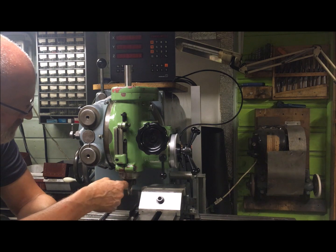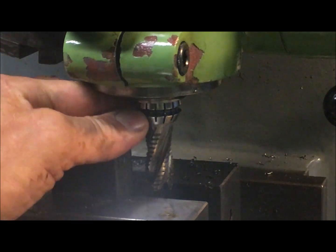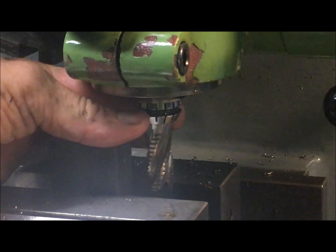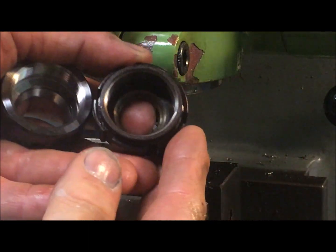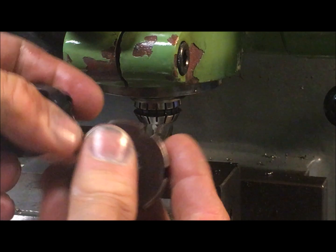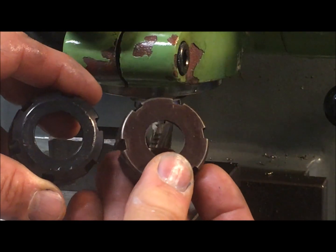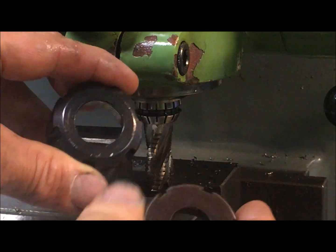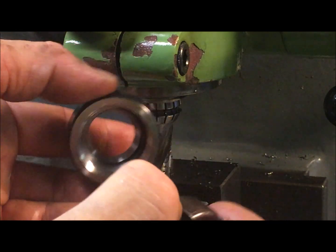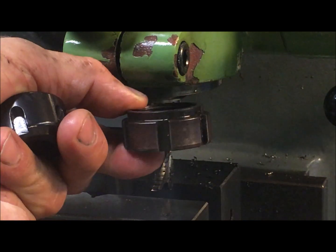Then I will have to make myself another nut here. Of course, it happened what I anticipated — namely that the collet is stuck in the holder together with the end mill. This is because, in comparison — this is the original E-type nut, and this is the ER-type nut. This is a new one, and this has a recess so that when you unscrew the nut, it pulls out the collet, while this E-type has not.